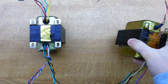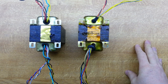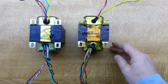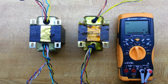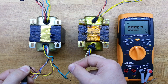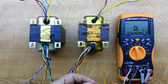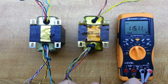This is a few weeks later, and we've got a replacement transformer here. These are custom transformers — this is the reason for the delay and complexity. It's custom made and came from Brazil. Just to do a quick check: what we found before was some of the windings were shorted. On the original transformer, between the green and yellow I'm reading half an ohm — that's where we concluded there was a winding short. On the replacement, we see 115 ohms, and that's what it should be, so I'm quite happy with that.